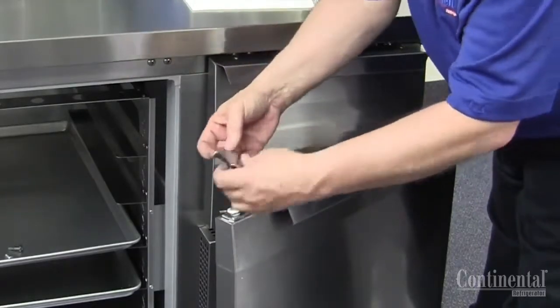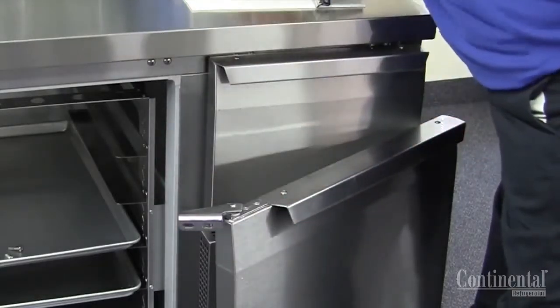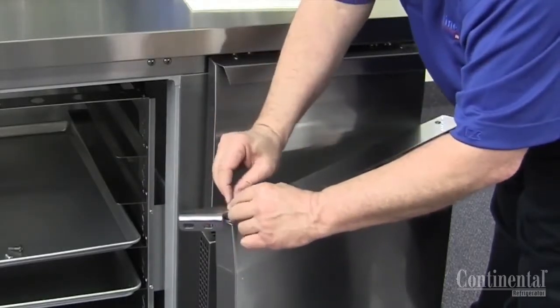Once that is done, take the hinge bracket and the lock washer, the Omega clip, the second lock washer, and the hinge bracket in the proper position. Mount that to the hinge cartridge and secure with the small lock washer and Phillips screw.